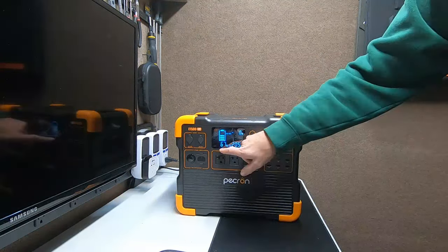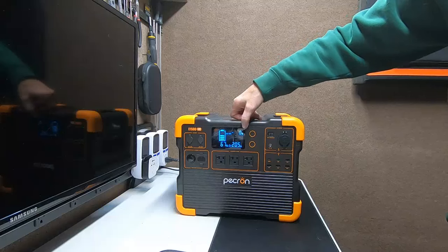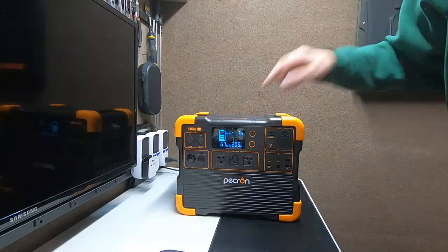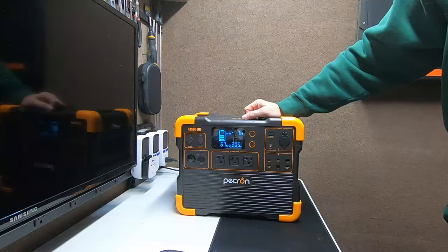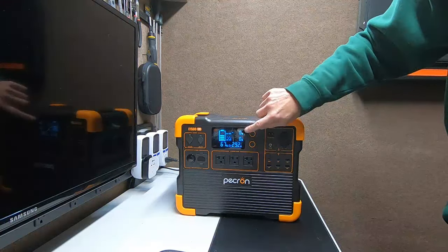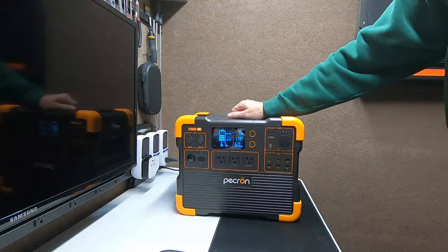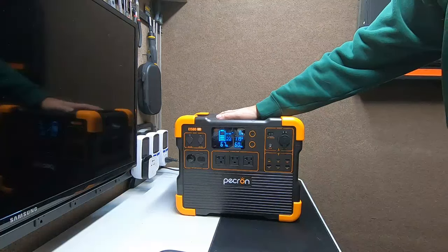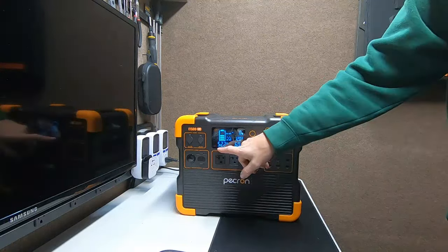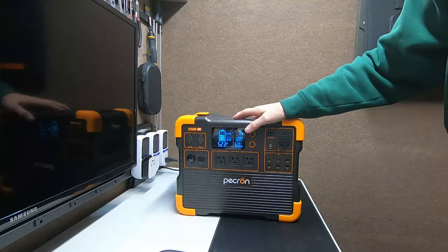So that's a nice thing. It gives you the same option as far as the percentage. Here's your battery wire frame. Your DC out is obviously at zero. That's rare because usually it shows about 1, 2, or 3 watts on the other one. So that's a little different. We'll do testing later. And then the other one, I think you have to turn on the AC. Yep, so once you turn on the AC, obviously you have zero and zero, and then you hit the AC button and notice that this changes to 60 hertz and 119 volts. So now you know that you have a 120-volt system at 60 hertz, that's pure sine wave, and then you have the 67% or 52.2 volt battery pack, which is known as a 48-volt battery pack, guys.